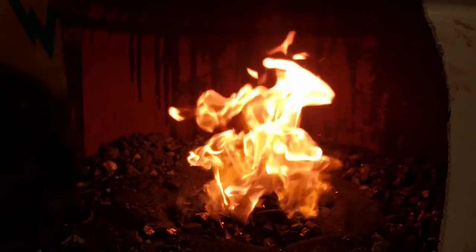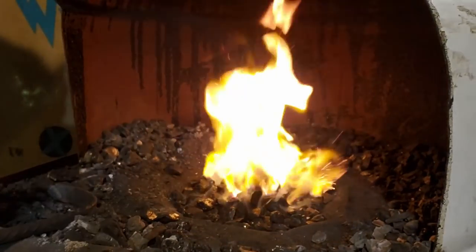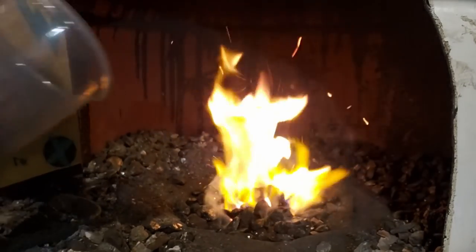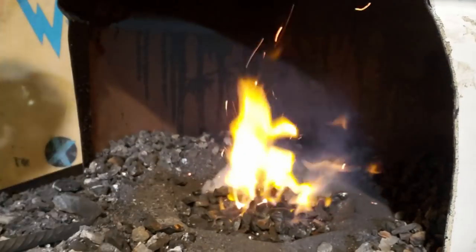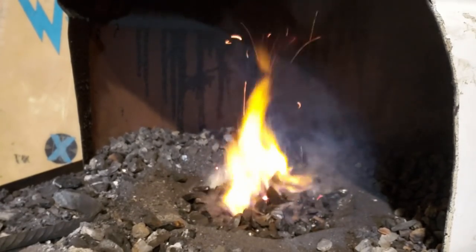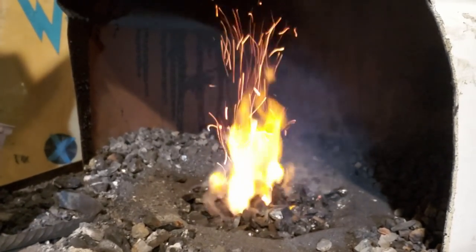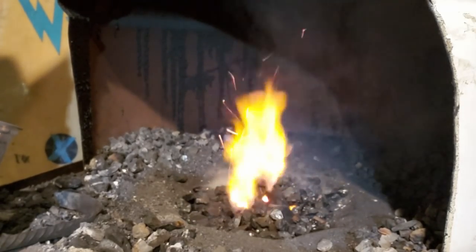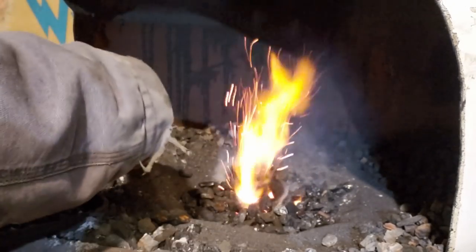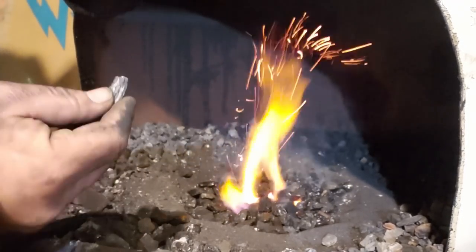Now with anthracite, you'll hear this popping when you're going from cold anthracite to a hot fire. It'll start to pop a little bit. Again, this is just how I start it. Now, I do have used coal, ready to light coal around the outside, but I want to show you from fresh.